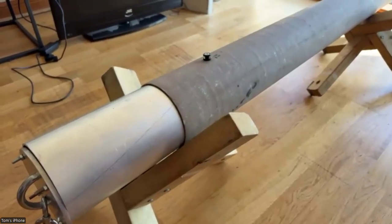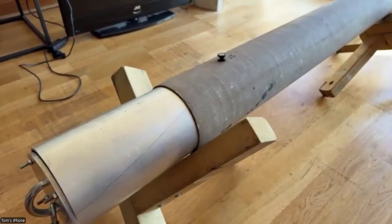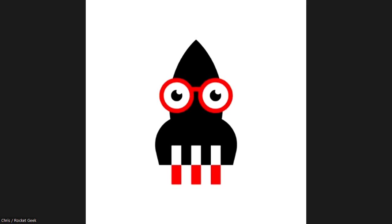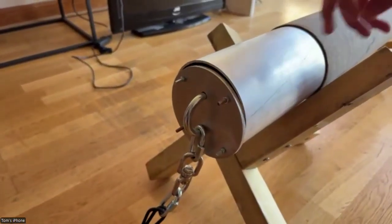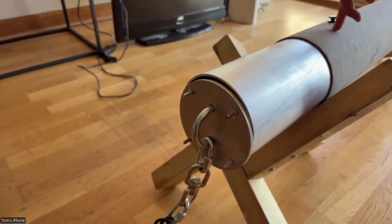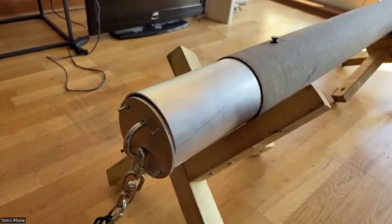That's our job for this week. We're going to be putting holes around the coupler. I think we're doing 8 M4s, tapping it and then threading it through. As well as these rods, which also run to the forward closure, all the way down here. So we have retention in the vertical direction, and some retention in shear, but most of the retention is coming vertically because we don't want to wreck the airframe if possible.